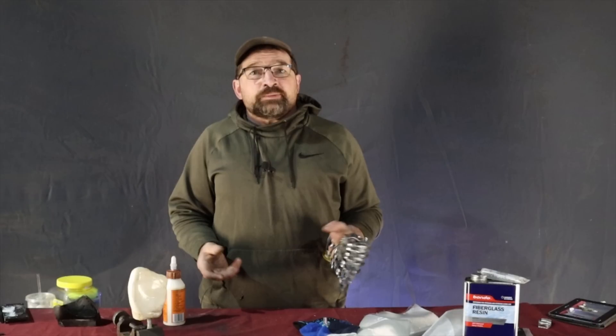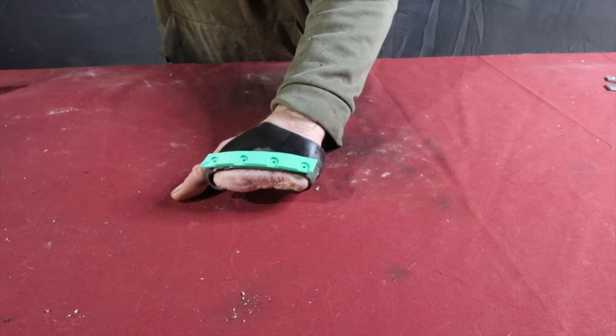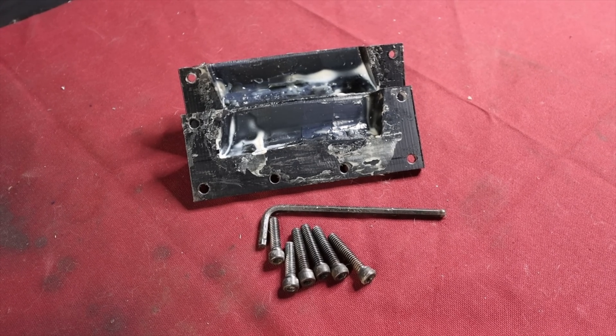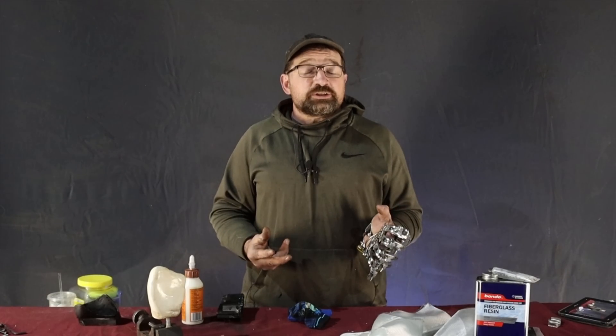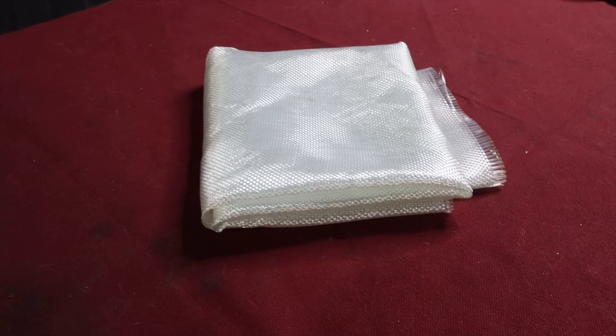For this demonstration I'll be doing a combination of wet layup and forging. We need the metacarpal end of the socket to be a specific size and shape so that everything fits properly when we start adding fingers to the build — that's where this set of printed dies comes into play. The inside profile is the shape and spacing needed for the mounting plates for the metacarpals so they can swivel and yet be firmly mounted to the socket. For the actual layup, I'll be using polyester blend toddler socks for the inner and outer shell, plus a third sock to stabilize the fiberglass at the midpoint. For the reinforcing layers, I'll be using six layers of fiberglass cloth, making this layup nine layers in thickness.